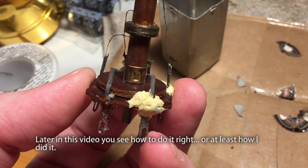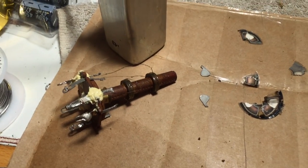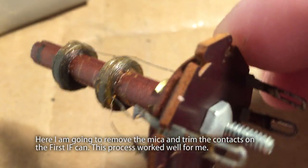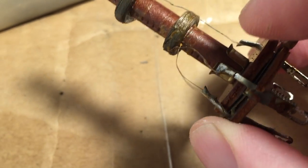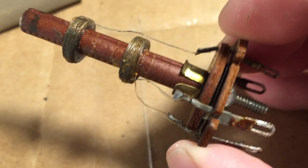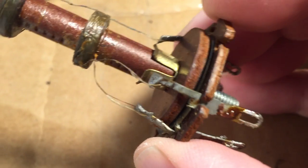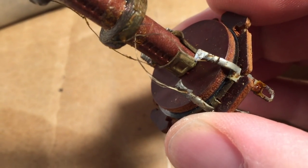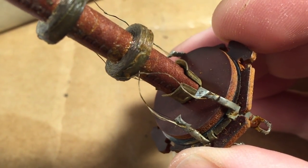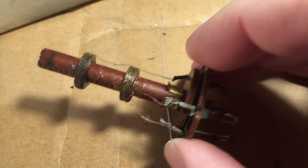Normally you'd just want to trim less off and not end up in that situation. So that's the first IF can — we're going to put it back in the can and seal it up. This time what I'm going to do is remove the nut, lift up the phenolic disc along with the coils, remove the mica wafer in the middle, and trim back the contacts. I'm going to be really careful to trim them longer than before so I can avoid having to glue them again.